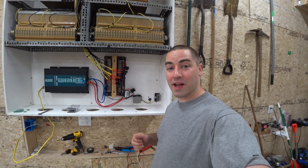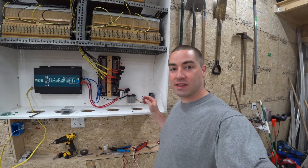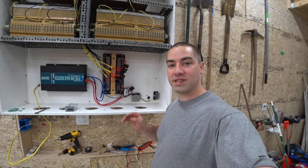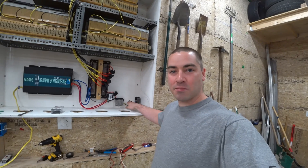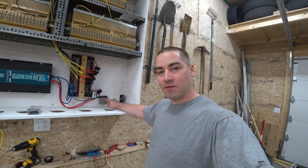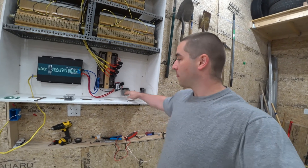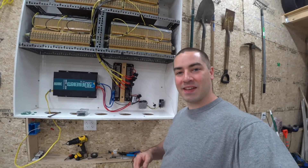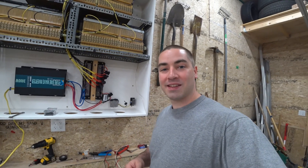We got 12 volts out of a 44-volt battery pack. I was very pleased to see that the step-down converter put out a nice 12 volts, even though the input voltage was lower than normal. Maximum 240 watts because it's only a 20-amp step-down converter, so you can't do a whole lot with it — but I don't need a lot. If you enjoy these videos, please like and subscribe. If you have any questions, leave them in the comments below. Thanks.